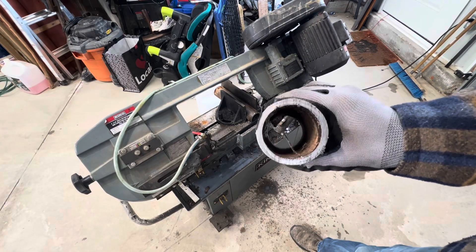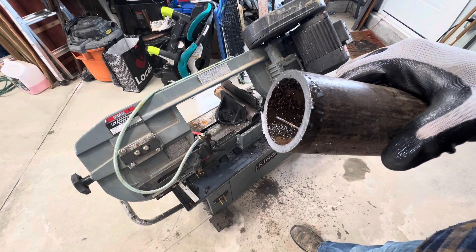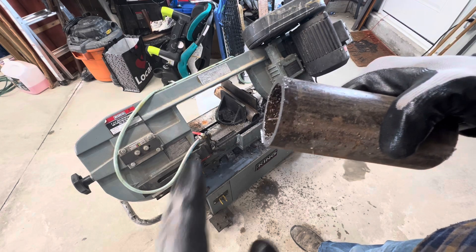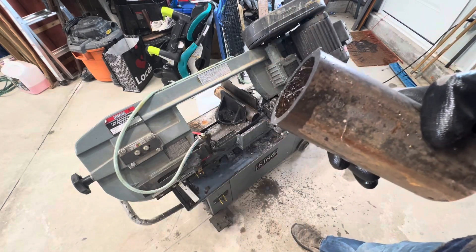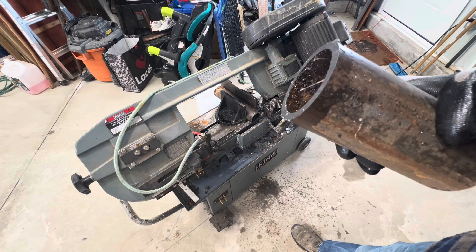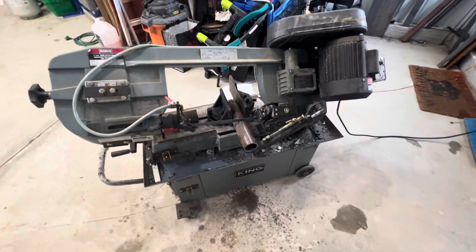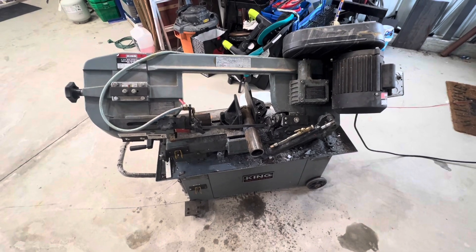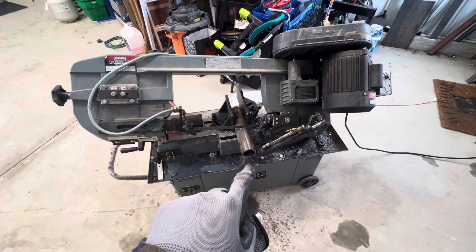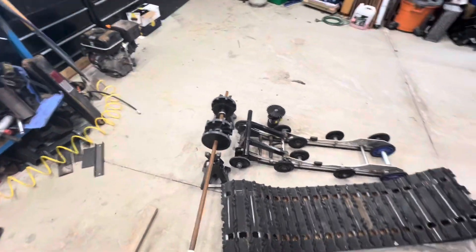This is why, when people ask why I don't have a plasma cutter — plasma just doesn't give you that type of cut. It's just so much easier to work knowing this is an actual true square cut relative to the dimension of the tube. Putting this into a lathe is way easier than some randomly cut piece of tubing from a plasma cutter. This is the other reason I love a good quality bandsaw over a plasma cutter — you don't have to do anything. The tool is doing all the work. I can go off and look at other stuff; I don't have to focus on that cut. I know when it's done, it's going to shut off and be good to go.